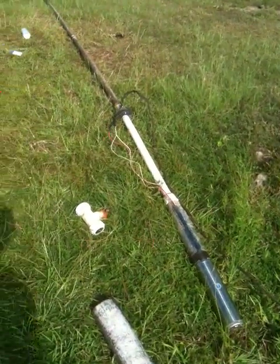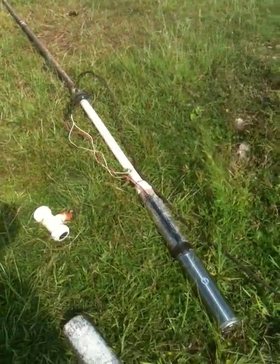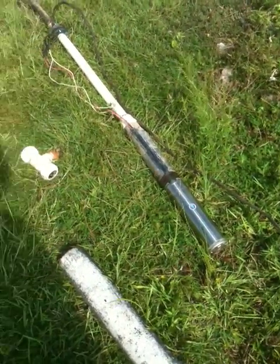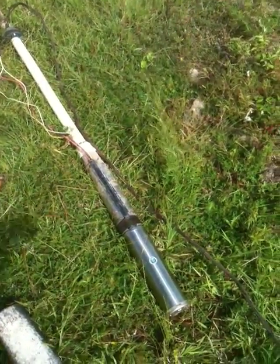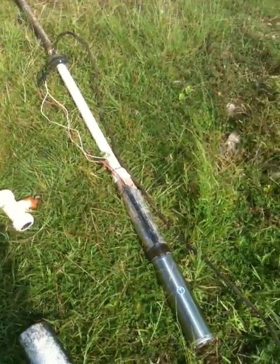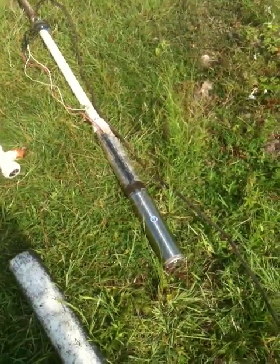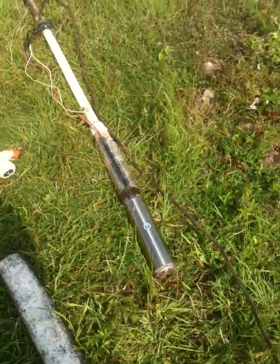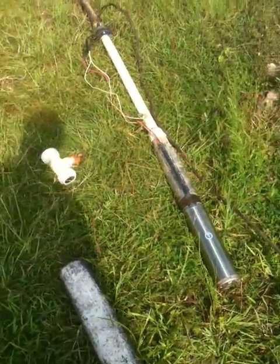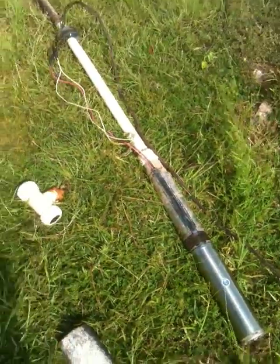And basic well pump stuff, which you can also get at Lowe's or Home Depot. What I have on the ground here is a two-inch pipe, and that two-inch pipe is connected to a standard well pump. You have to size the motor to match the head or the rise you need to get water to your sprinkler system. This particular motor is a Franklin Electric three-wire 1.5 horsepower.